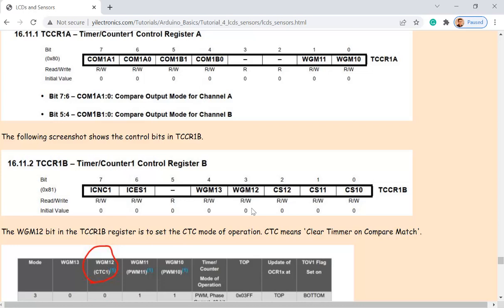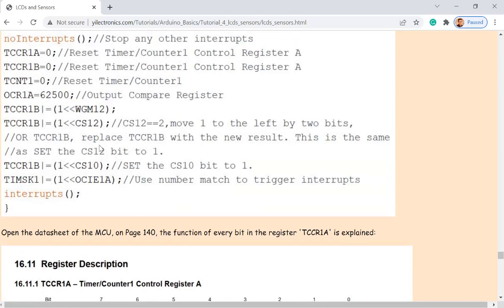But in Arduino, it's more confusing. If you want to make this bit 1, this is how we do it. Why does this work? That's the register, right? That's the one bit, a single bit in the register. And by doing this, it's going to set this single bit as 1 in the 8-bit register, but not other bits, right? Just that bit. How does that work?